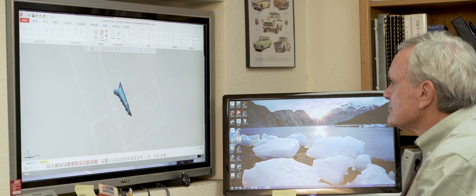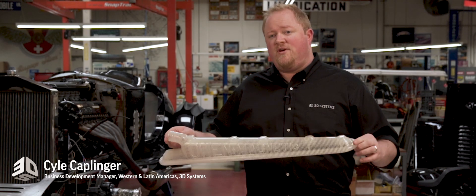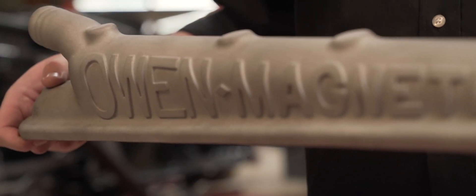The next process is to create a quick cast SLA pattern done by our 3D Systems on-demand manufacturing services. Stereolithography is by far the most accurate print technology available. You'll notice fine feature detail and a superb finish quality on the part, and once slurried that results in a fantastic final cast that's ready for polish right now.